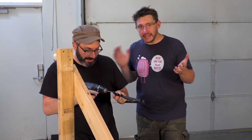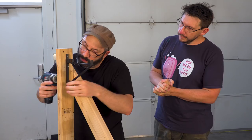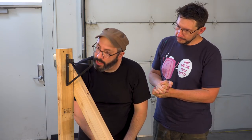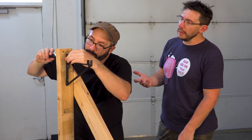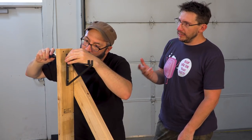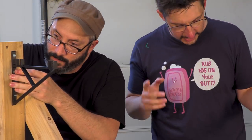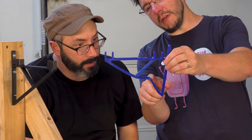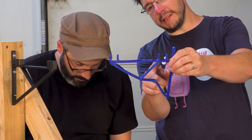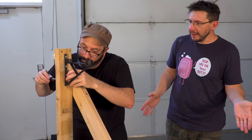So this is it. This is the Nylon X. This is carbon fiber nylon, the kind of thing you would use when strength is an issue. I think so, because nylons generally don't have any layer adhesion failures. When the nylon is printed, the layers stick to each other pretty well. I think we're going to see bends similar to PETG. But look at that. You can easily see that if there were a couple more triangles in there, we could probably, well, we'll talk about that at the end. But I think we could design this shelf to be even stronger.